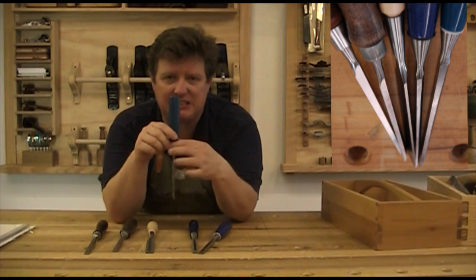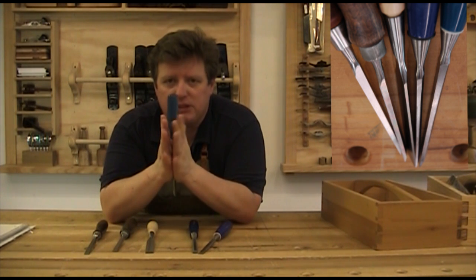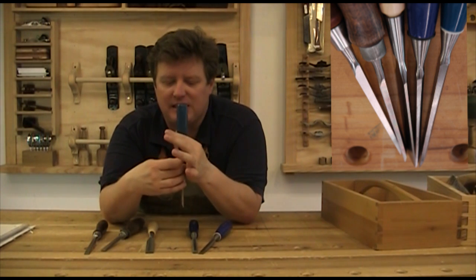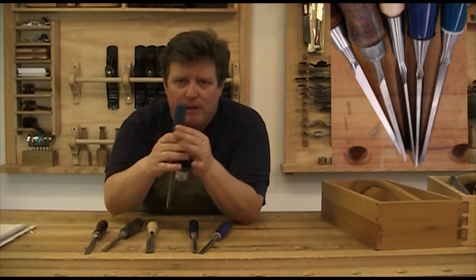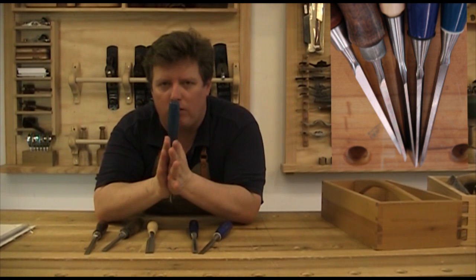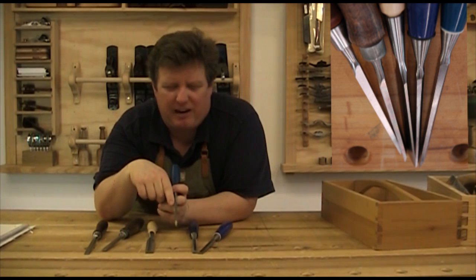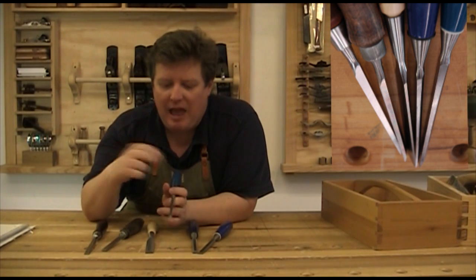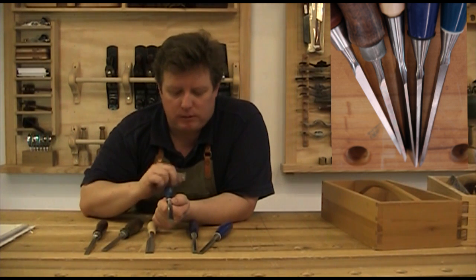Because if you have a decent sized taper on the side, when they get these things red hot and then stamp them, almost immediately that metal starts to cool, and when that metal cools, it shrinks ever so slightly. So having that taper there will mean that this chisel will release out of the mold and they can just lift it up. If you had no taper whatsoever, more than likely that chisel would get stuck in the mold and you'd have to have a lot more force to get it out of the mold. So having that taper there, in my mind, is probably a way to save money in the manufacturing process, at which point they just lightly sand the bevel to make it look like it was ground.